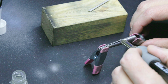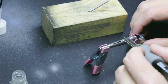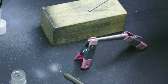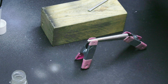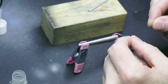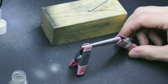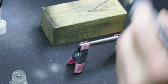I don't want to be on the material for very long. And if you've got a lower temperature set on your iron, you're on the material for a long time. What happens is you start getting the material really hot because it's a big heat sink. So the heat's just wicking away from the joint, and instead of getting the joint hot enough to solder, it just spreads out. So then you end up getting the part really hot, and then you run the risk of melting the part. So having a really hot iron actually reduces that risk.